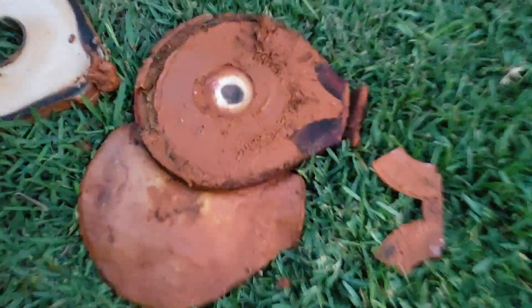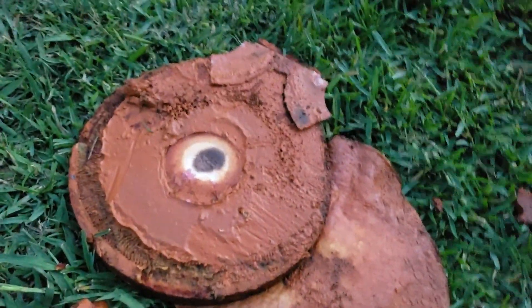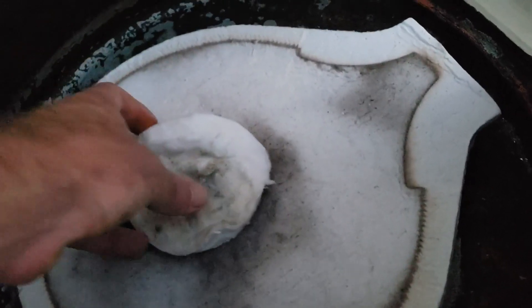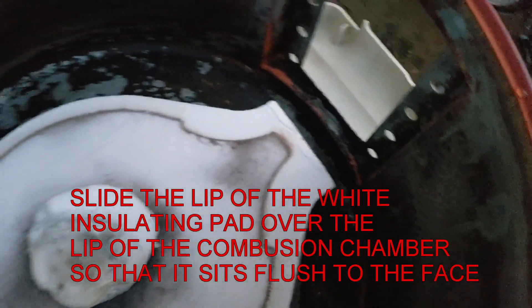I took these out in order. This piece here was sitting on this like that — it actually rusted off the bottom, which the new one has attached right there, all shiny. So since these are in order, I have a flat piece with no hole in it, and then a piece with a ledge, a lip on it, and then a circular piece. This is how the new kit came — it has a pad on it that goes in the middle, and then a flat pad on the bottom that's just going to sit there. The bottom piece is soft and the top piece is a very hard piece. I'm just going to stick this in and then stick the rack in so it rests on that lip. One of the bolts will pull it tight and it should make a seal.